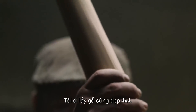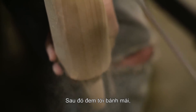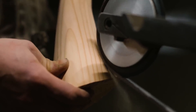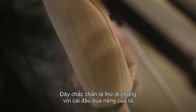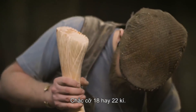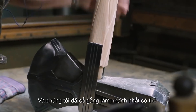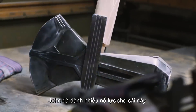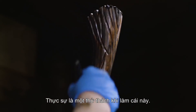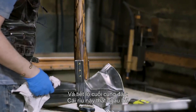What I did was take a 4x4 of nice hardwood, took it to the sander, and carved my shape. Afterwards, I went to the narrow wheel and carved in a natural tree branch kind of texture. With something this heavy — our hammerhead probably weighs 40 or 50 pounds — this is definitely the way to go. Only a couple weeks ago you guys requested this build, and we did our best to make it as fast as we possibly can. John put a lot of effort into this one. It was a real challenge making a box around a hand-forged piece. For our final spoiler: this axe is awesome.